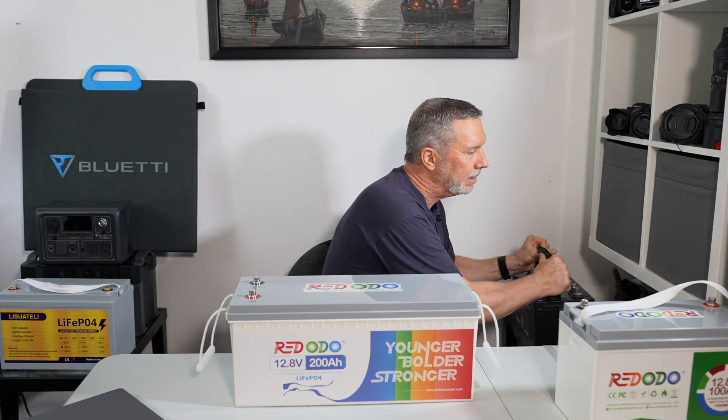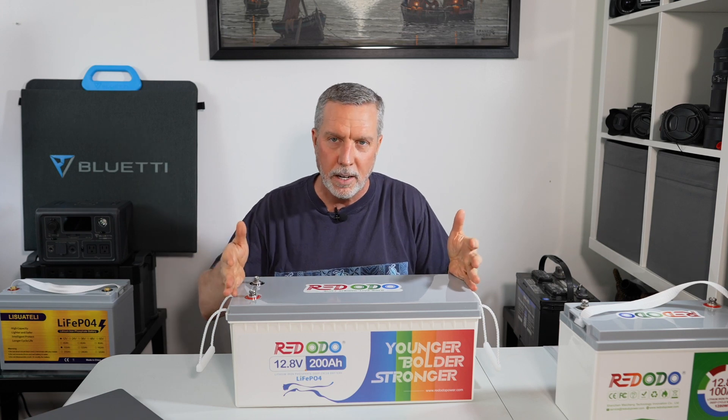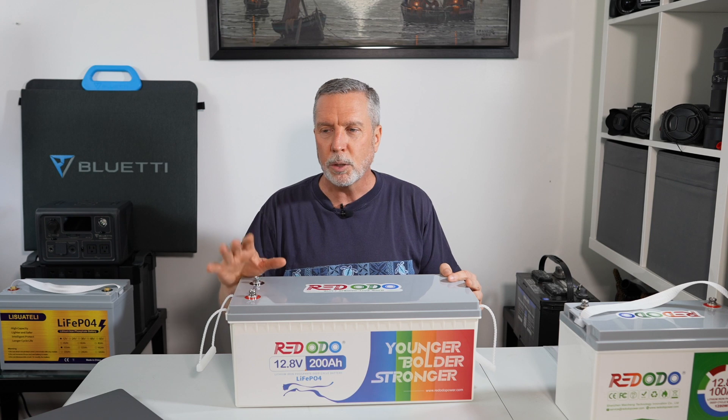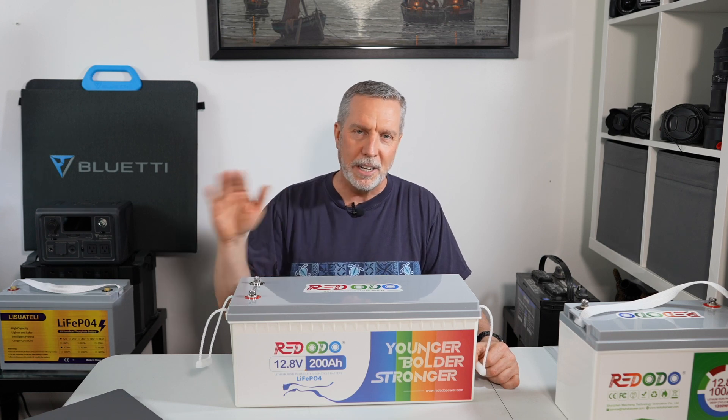I came from four lead acid batteries, which weigh 55 pounds each. I replaced all four with one 200 amp hour lithium iron phosphate battery and it felt like magic — honestly, it felt like magic. With the lead acid I always had range anxiety, capacity anxiety. I was always checking: how close to 50% is it? Because with lead acid you cannot go below 50% of its rated capacity or you start damaging the battery. When I switched, the same appliances were running — my fridge, my secondary fridge, my laptop — and the battery barely moved down. This thing is magic.